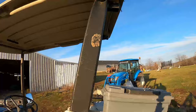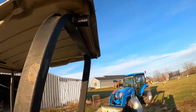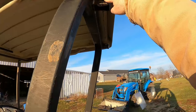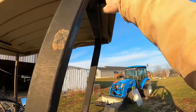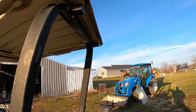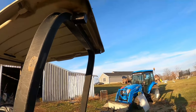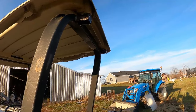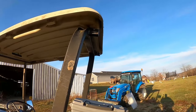In the back of it, we had some frame parts that were left over — I think I showed them in the last segment of the video. What we ended up doing was cutting them short so they could bolt into the golf cart top. They've got a little area that comes down, and we welded them onto the ROPS, the rollover bar. We did not drill into those. I've seen some people make tops and drill into the ROPS, but that kind of messes with your structural integrity. If you did happen to roll your tractor — I was a little leery about even welding it, to be honest.